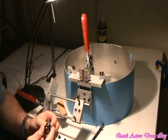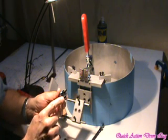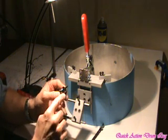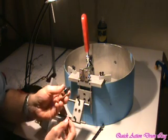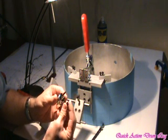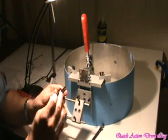The R1 lug uses two mounting screws to help prevent torque on the shell, because it distributes load over two different attachment points. Through the shell, once you drill your through holes, the idea is to use a 17/64-inch diameter drill and use a nylon insulator that will keep the threads from your screws from touching the shell.